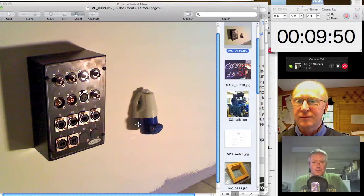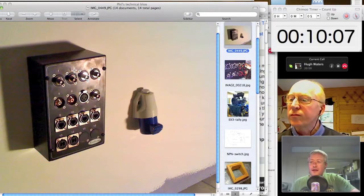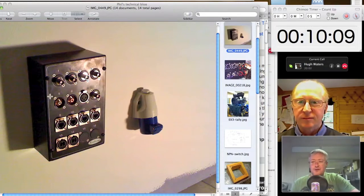As part of this job, we've got about 70 rooms that need custom wall boxes in. And I've got a typical kind of custom wall box, the kind of thing we do, up on screen. BNCs, audio connectors, RJ45s and even optical connectors on there as well. And that's just a bolt together piece. That's a couple of hours, bolting those connectors in